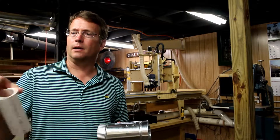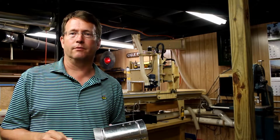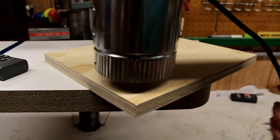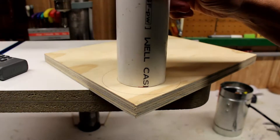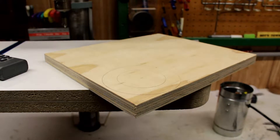And now I'm going to cut the disc out for the inlet side and at least get that part together so a little bit of this sticks out so I have a place to clamp on the flexible hose. So I've taken the can and drawn a line out on here like that, and then there's a piece on the inside for the 2-inch PVC. I'll cut that a little small and sand it, and that will go in.